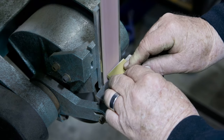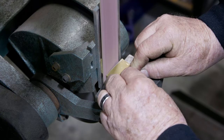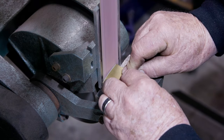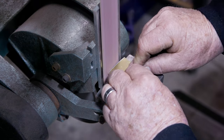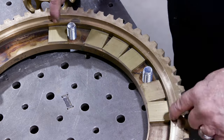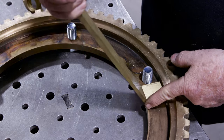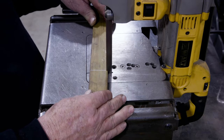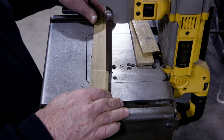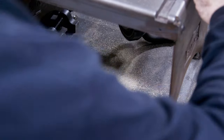Just taking a little off with the grinder — there's not much coming off, just a very little. That's all we really need to make that fit flush in there. Right there, you can see they fit nice and snug. This is the idea — going to weld them on there like that. So let me get these pieces cut, a total of six of them and they're 12 inches long. The beauty with brass is it's super soft and you can see it just cuts really nice. Look at all that gold dust — brass dust.